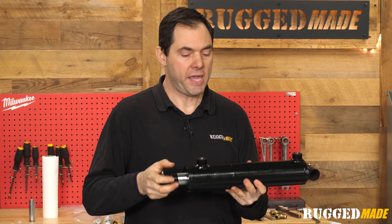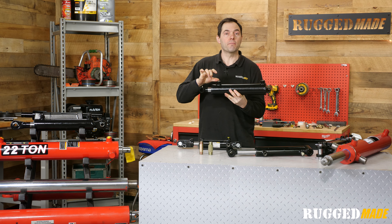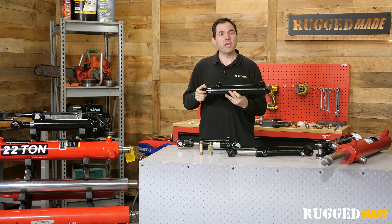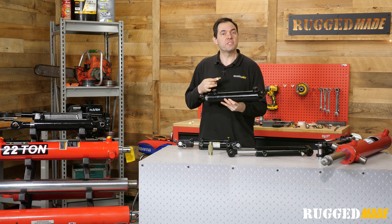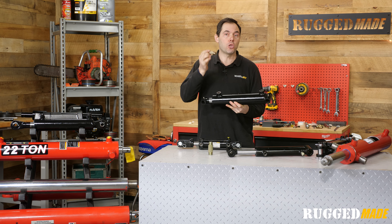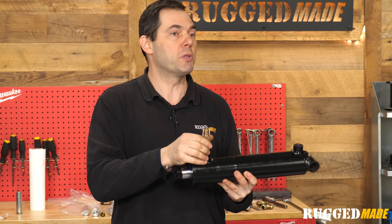One interesting feature of a tie rod cylinder like this is there's one port on the gland end giving a 3 or 9 o'clock orientation, but there are actually two ports on the base end and one would normally be plugged. If you wanted to change from the 3 o'clock to a 12 o'clock orientation, you can disassemble the cylinder, rotate that base 90 degrees, and then you would have a 12 o'clock orientation. Some custom cylinders may have an extended port tube — you might see a 2 or 3 inch long tube. Finding a replacement with the same length port tube can be difficult, but sometimes you can make a more standard cylinder work by using a long straight fitting, probably male to female, threaded in to give you that tube length.